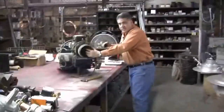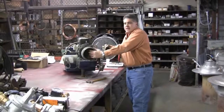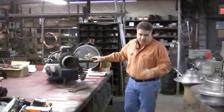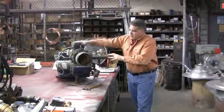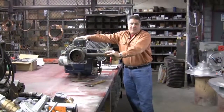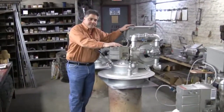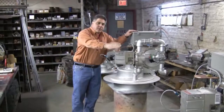Now an explanation about the high-pressure zone and swirl of the air turret — this is how they do it. This diffuser plate has been around only about 25 years. They do not get the same back pressure that the Inferno Therm burner achieves. The Inferno Therm burner can fire against 6 inches of back pressure in a combustion chamber using our patented cloverleaf — that's how we gain efficiencies. This competitor burner fires down a much larger fire tube with no back pressure, only up to 2 inches. We've done tests and seen stack temperatures on this equipment of over a thousand degrees. Comparable Inferno Therm burners have stack temperatures of only 450 degrees. Statistics will tell you that is where stack temperatures should be to burn off moisture and oil impurities in the fuel.